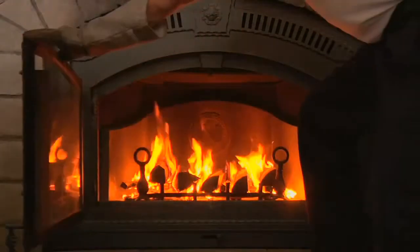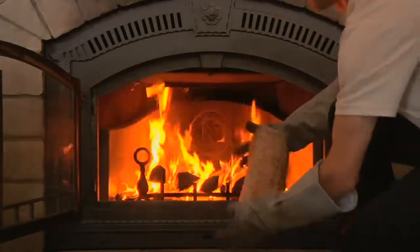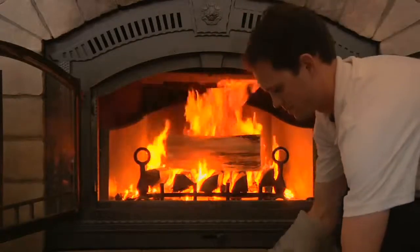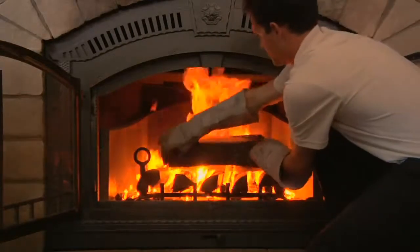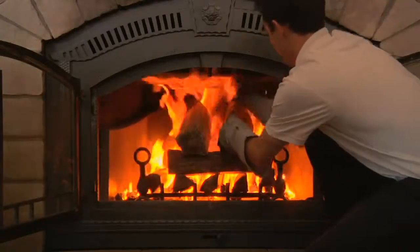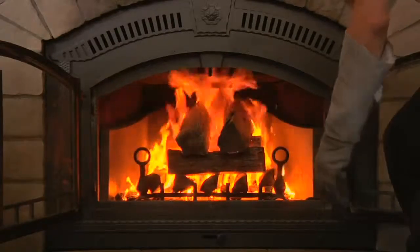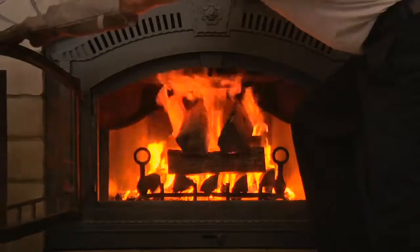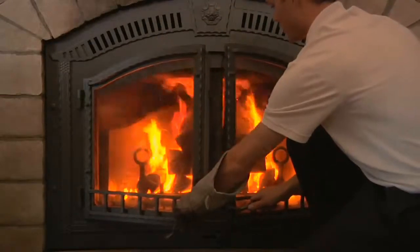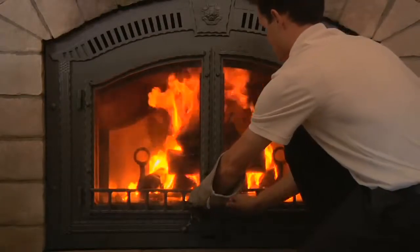During the next reload, you can load the fireplace with a minimum of 3 large log pieces to the top of the andirons. This will provide you with longer burn times. Depending on the chimney draft in your installation, you'll soon learn how large the logs can be. For fires with poorer chimney draft, multiple logs of smaller diameter are preferred. Every wood-burning fireplace is designed to operate best when it's heated up, and the NZ6000 High Country is no different, needing big fires to accomplish this.